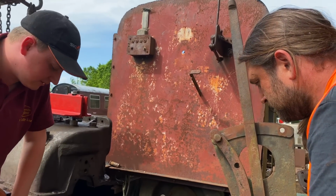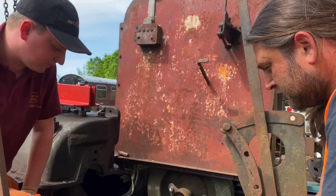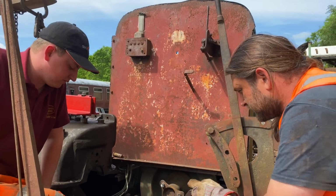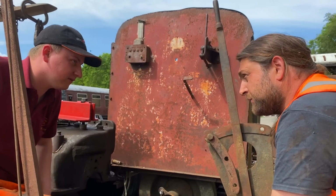It goes. Yeah. So, do you know what I'm really surprised about? The fact you have the single drain for this, yet there are separate compartments that don't all interlink. There are 2 drains. Oh, there. There are 2 sump plugs. There's the drain on the front for the final drive. Yep, and there's also one right at the back. Yes, here. So I've drained both of those.